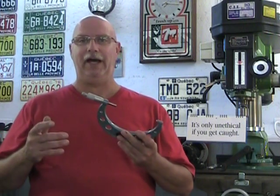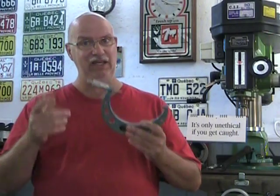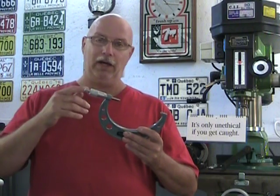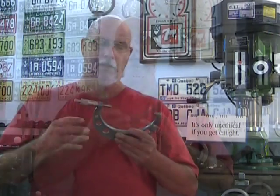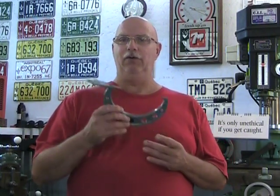These are really nice tools and very accurate. It's not the kind of tools we use every day though — we use a micrometer when we need an accurate measurement. And if we're using one, it's because we need that accurate measurement, which means it should be well adjusted and read properly. So let's take a look at how to read a micrometer, and then we'll look at how to adjust and calibrate it.